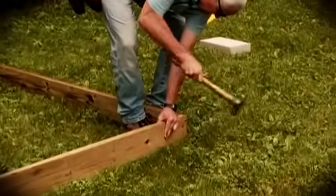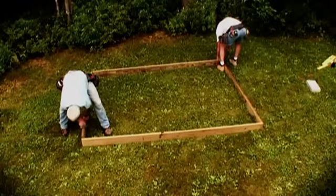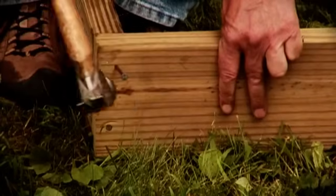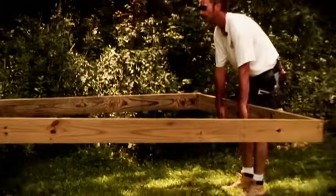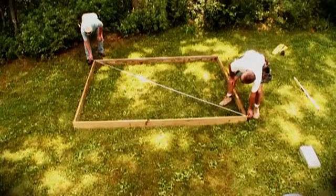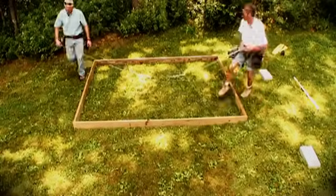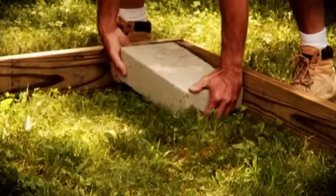You can get this length from your plan. Lay the perimeter joists out on the ground, then nail them together with 12D or 16D galvanized fasteners or sinkers. Once nailed together, use the box to position your shed exactly where you want it in relation to the house and the yard. Cross measure to roughly square the box, then place the concrete blocks in the corners to establish the places to remove the grass.